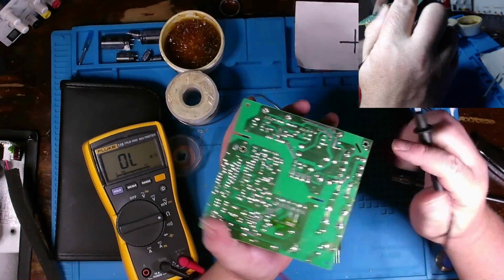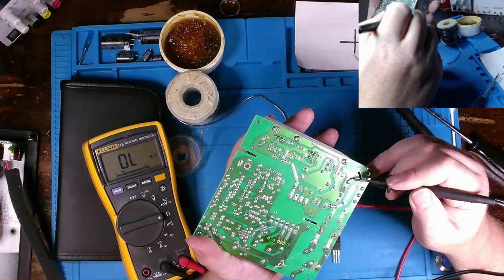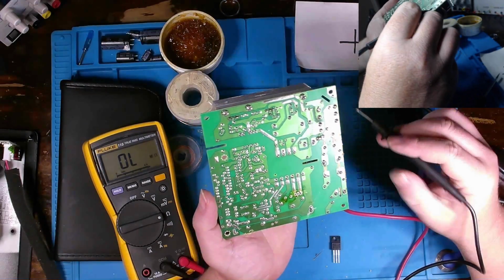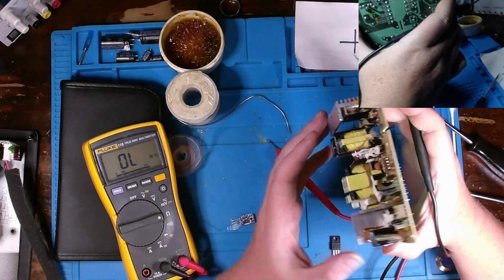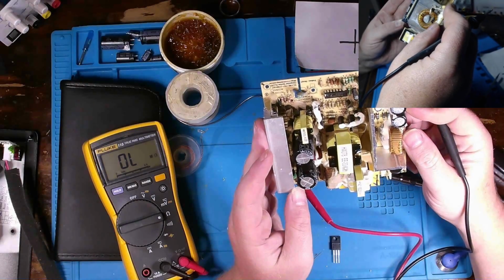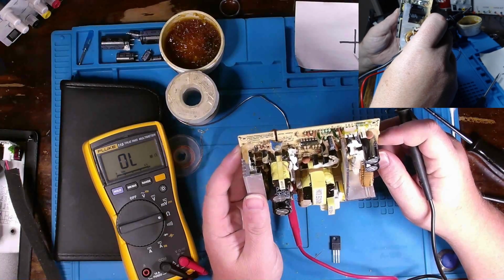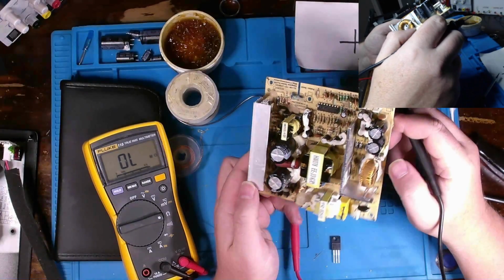However, there are some very poor soldering terminations here on the board that I can touch up as well. So I think the best thing for me to do is still get these two components replaced, and then power up this board and do something that I typically try to abstain from, and that's doing measurements on a power supply PCB while it's energized. But there really is no way around this. But yes, that's the way we're going to have to go. So I'm going to get those components soldered back in, and we'll do some more troubleshooting.